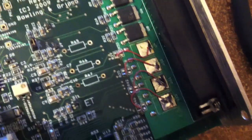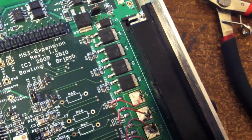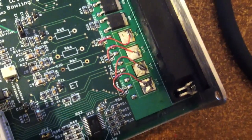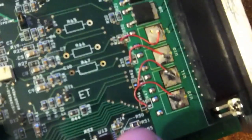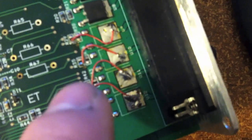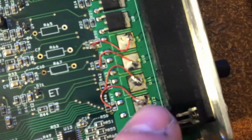I've got the jumper wires installed. I removed the first four injector drivers and left the other four in case I want to drive relays or something with them — I wouldn't drive injectors with them, I don't trust them. I removed the surface mount resistors and took from the 10-pin ribbon cable right here. You can see the traces come straight up, go through some vias and do some funny things. I metered them and they go to that side of each of those load resistors. I jumpered from the cable, which is unbuffered CPU pins — so you've got to be real careful with these outputs now. You run those to 12 volts, you're going to fry the CPU. They go through these jumpers out where I'll have the peak and hold board in the wiring.